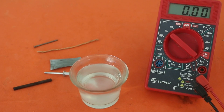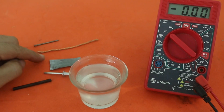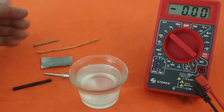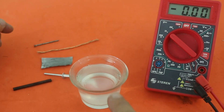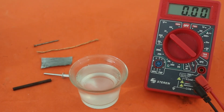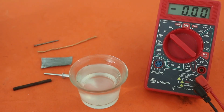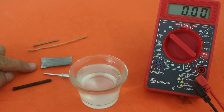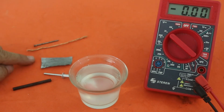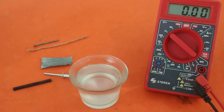As you can see, we obtain different voltages using different pairs of materials. Each conductor has its own potential when it is in the electrolyte, and this is known as the standard electrode potential. It is a characteristic of the conductor. So, when we have a large difference in electrode potential between two materials, we obtain a large voltage from the battery, and vice versa.